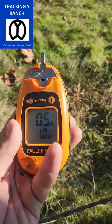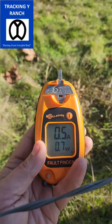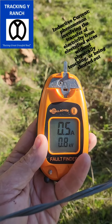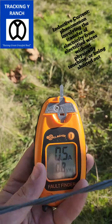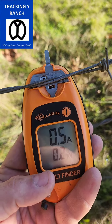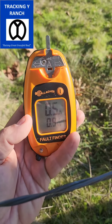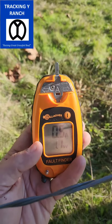The main thing is this is the Gallagher Fault Finder. You can see it's picked up a little bit of inductive current — this is the current in the air, so we're not even touching anything. We'll often have people say my outer fence is giving me a reading. Well, it's just the field that's out there, so don't think it's always the fence, especially when it's super low.